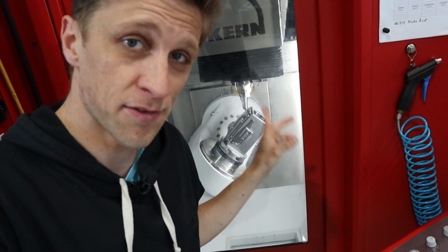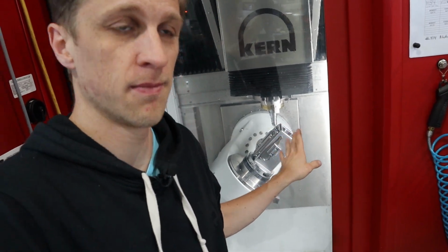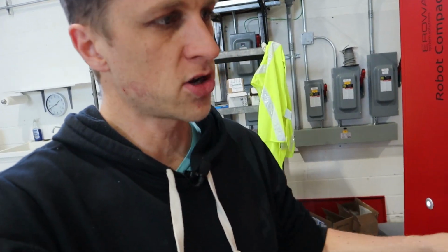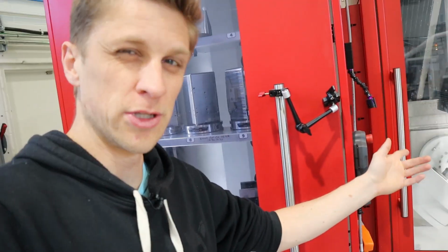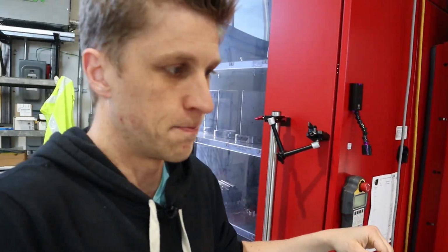So it's not fun to have the machine e-stop itself in the middle of a cut, in the middle of a program, ruin the rest of my night run. I had 3 Rask pallets on for last night. It finished one of them. It alarmed out probably 2/3 of the way through the second one, and it did not get to the third one yet. So I'm behind from my scheduled plan from a kind of a dumb issue, chips wrapping around the float. So I got to fix that because I need it to not happen again.